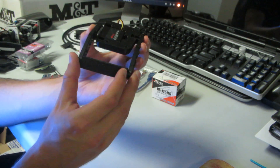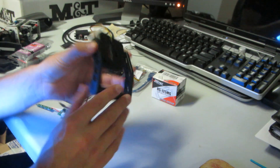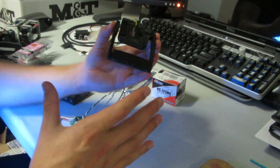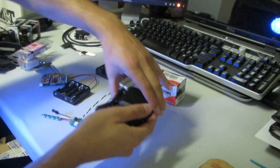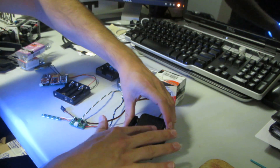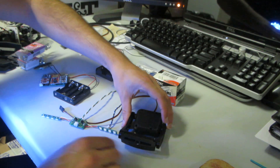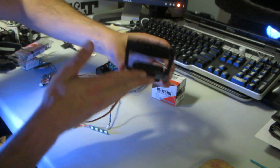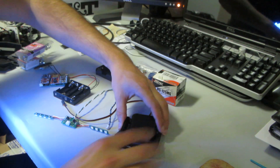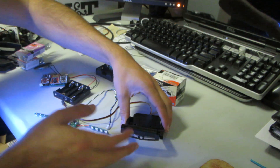Once you've mounted this on the inside, generally what I do is turn the helmet upside down, use a bit of tape to secure the faceplate to the helmet, and then just place this so that it fits nicely — this part on the forehead tab and this part against the inside of your faceplate — and you'll get the perfect spot. Then you can hot glue it in, screw some holes in there, use some double sided tape, or hot glue — it's up to you.